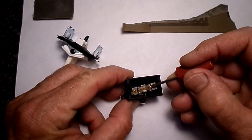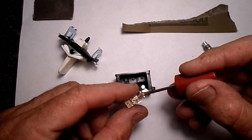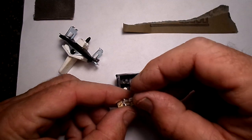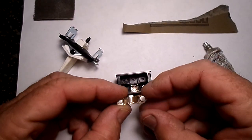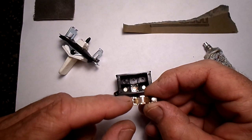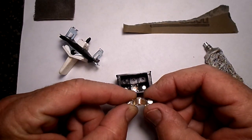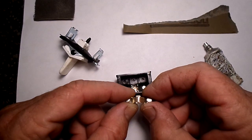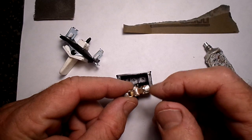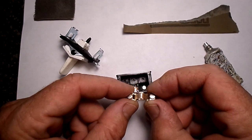I can take them out and let you see — this is one that I've already cleaned up. But basically I pulled this out of here and found that the contacts were pretty black, so the switch was no longer working. This is a silver-plated contact here, same with this one. When I clean them up I want to be careful not to clean any harsher or harder than I need to, because I like that silver plating on there — it's a good conductor.